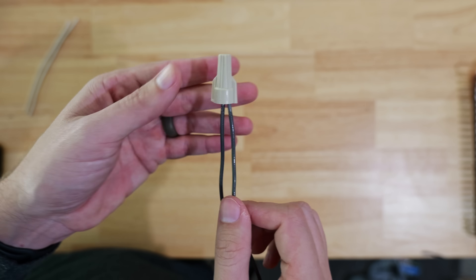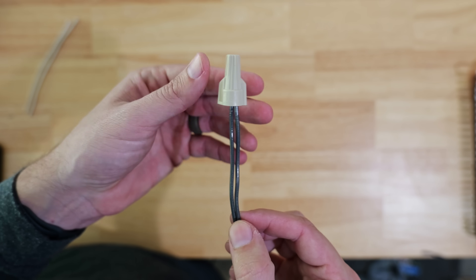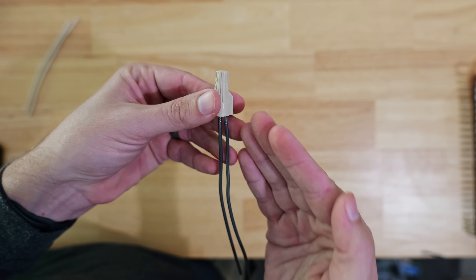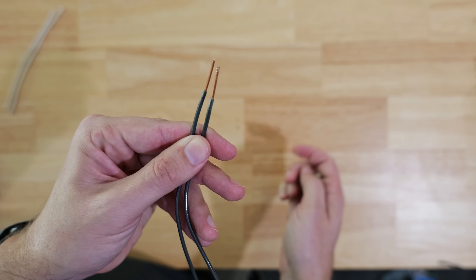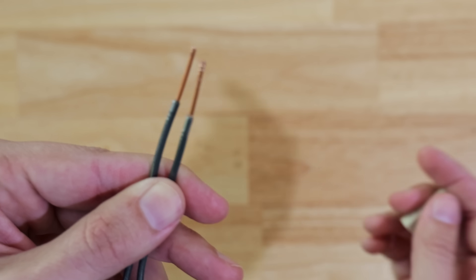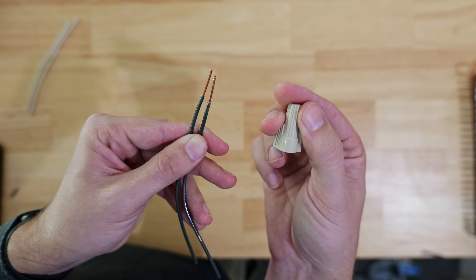To give you a demonstration: while nobody's going to be in your wall pulling on your wires, wires do vibrate due to the current flowing through them, and that's why they can fall out over time if you don't have a nice tight connection using a wire nut. Both of these wires were connected underneath this wire nut, but the problem is the instructions were not followed — we were completely relying on the wire nut to hold the wires together.